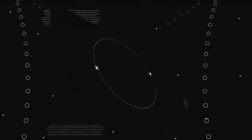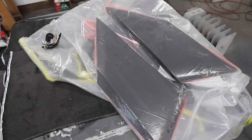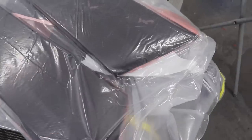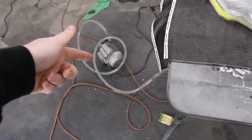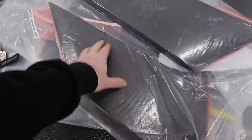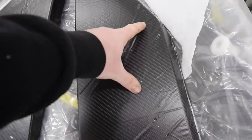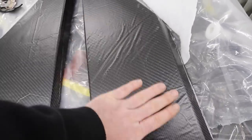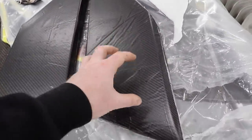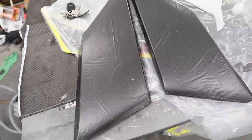I came in first thing in the morning and turned off our vacuum pump. Lesson learned: we used an old vacuum bag that had been through some stuff and we didn't put enough breather cloth in there, so it had some small holes. We have a really good vacuum pump provided by the guys over at Fiberglass — link in the description — so we left it under vacuum all night long. These are looking very good. They came out pretty good. Anywhere there was a big wrinkle in the bag it created a wrinkle in the resin, but that's a high point and it's very easy to sand down. What I was really going for is this nice uniform shape that's all infused with resin — nice and strong, very sturdy and durable. Next step is block sanding to make them smooth so we can clear coat them.